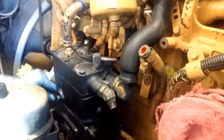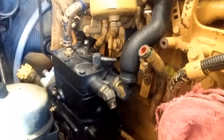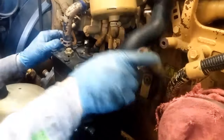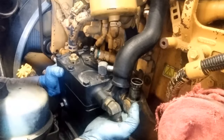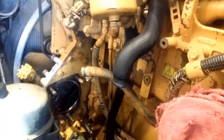This is an SDP with a twin piston style air compressor. These twin piston style tend to go out a lot. Whenever I get a customer in with an SDP, I usually ask them how long they've had that particular air compressor because they tend to fail a lot. If you're having a problem with your Regen C15 losing air compressors, there is an update where you can install a Bendix single piston air compressor onto the engine, opposed to using the twin piston one which seems to fail more often.